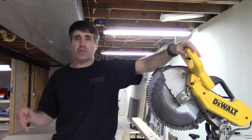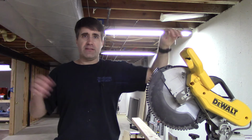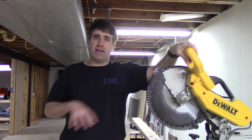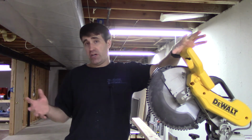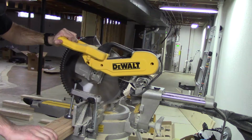While the tabletop is drying, let's cut the 2x4s that are going to be used to make the outsides of the legs. I'm going to lay them down on the ground and sort them out in terms of where they're going to sit on the final table. Then I'm going to mark them up very roughly as to where I need to cut the grooves for the pieces that connect them together.